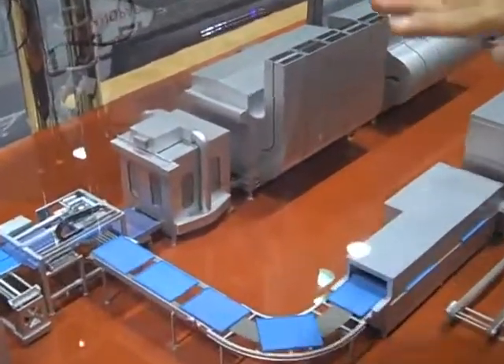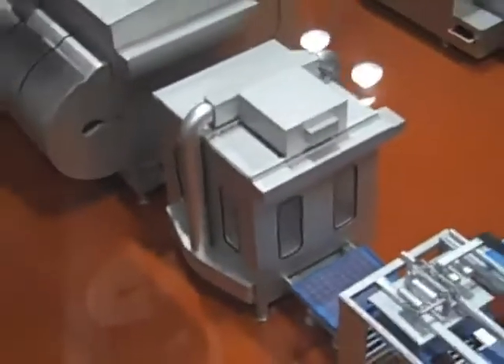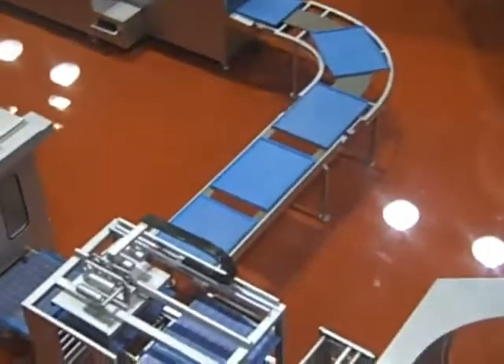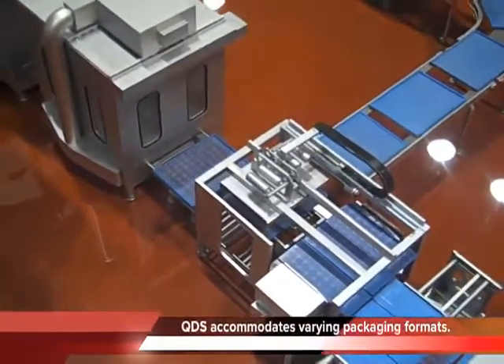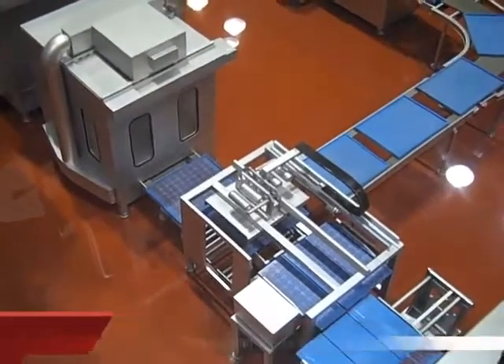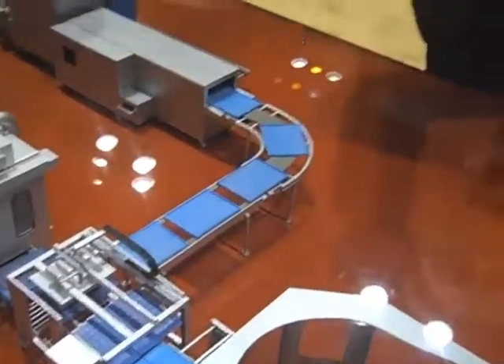After this, we arrive to the bottom floor. The product here is already finished — it's dried. We pass through this unit, which serves two purposes. From one side, in case you need to change something — for example, a small stop on the thermoformer to change a plastic roll — it gives you a certain time to accumulate without stopping. It's an accumulator. The other mission is: this unit has a heat exchanging unit, so you can chill down the product in case you are making modified atmosphere packaging. If you have a product getting out at 20 degrees in vacuum it has no problem, but in modified atmosphere packaging you have the risk of condensation.